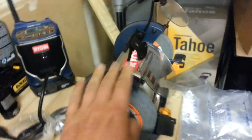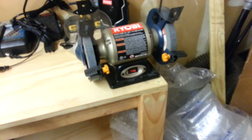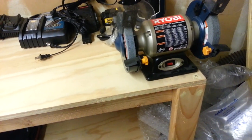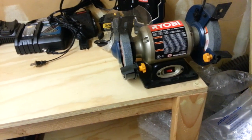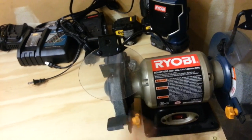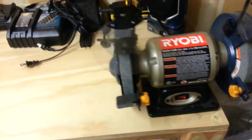If anyone wants a really economical bench grinder — I sharpen a blade in, you know, for my 52-inch Hustler or my 42-inch Husqvarna, I can sharpen those five blades in literally 90 seconds. All of them. I have them stacked here, I go three times on each side, and I get a nice sharp brand new edge on it. I'll do a video showing how I sharpen my blades.